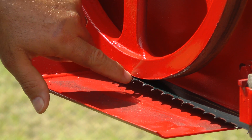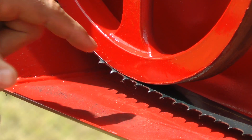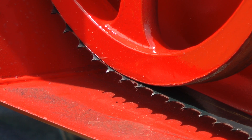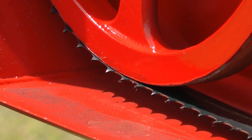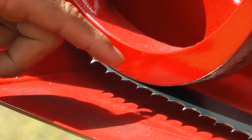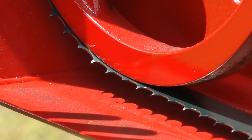You can see — you may not see that as well — but it went back a sixteenth, maybe a little bit more. And when I tighten it up again, you'll be able to see that. I'm going to go forward about four rounds, and you should be able to see that come out. Now I'm going to spin it in the direction that we cut, just a couple of spins. And now if you look, you can see — not quite out an eighth — but we have some metal in the gullet coming out over the edge of that wheel.